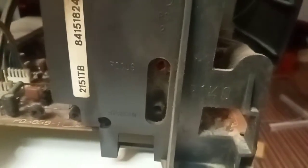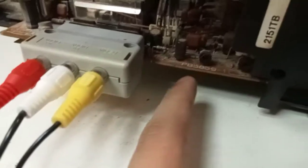Obviously you've got different pots, like the focus pot, which is like focusing and unfocusing binoculars, and screen, that is just the screen brightness, and I've adjusted it just enough to fix it. That is sub screen brightness. I haven't touched it yet because I don't need to. I probably do, but I have no idea.